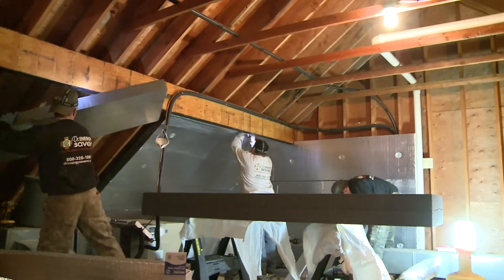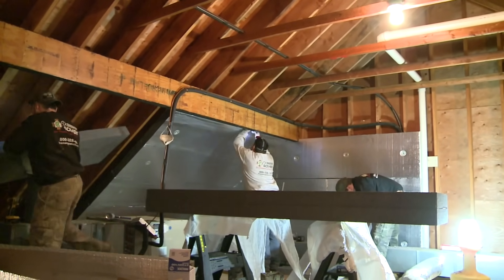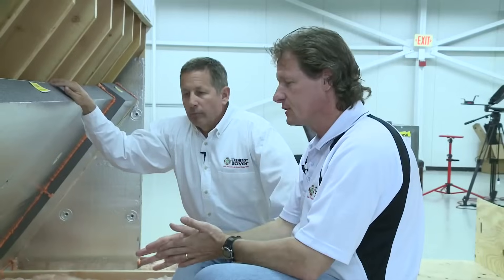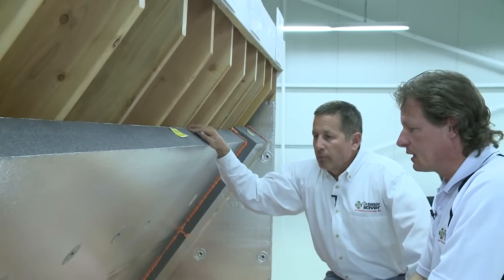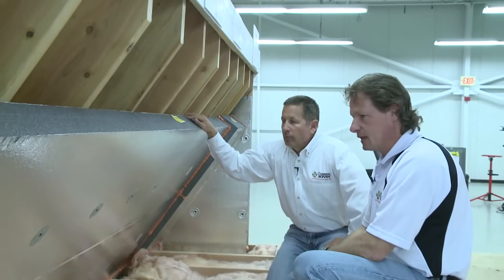So we're going to have a colder roof, we're going to have less ice damming, we're going to have a cooler roof in the summer — because we still have a vented roof to vent excess heat that radiates from the bottom of the roof deck from the sun. That excess heat can get out. So the insulation isn't doing all the work in the summertime; we have some ventilation taking some heat away.